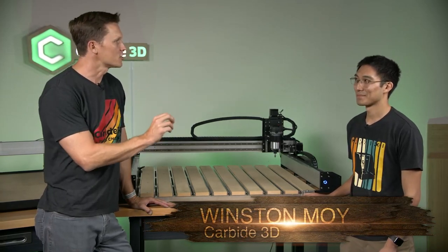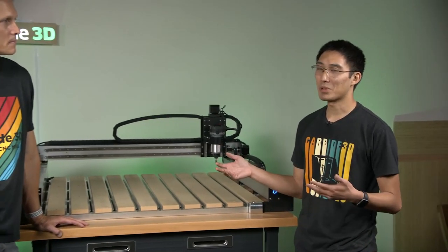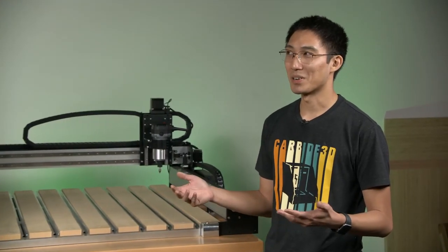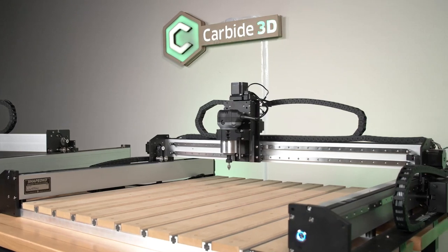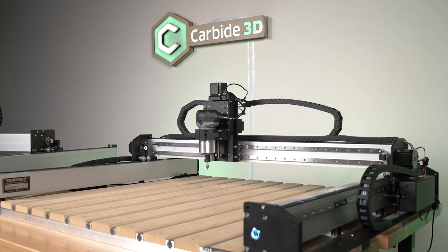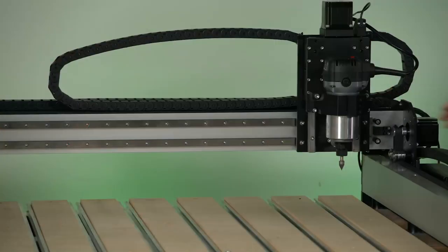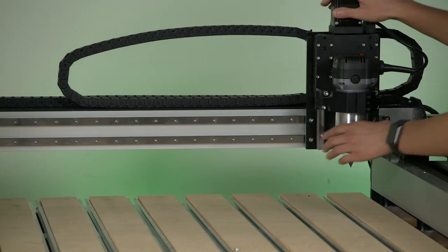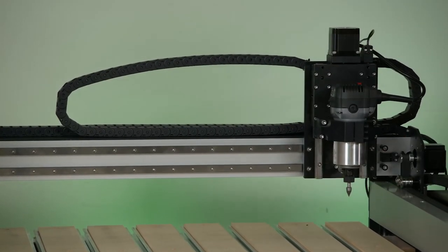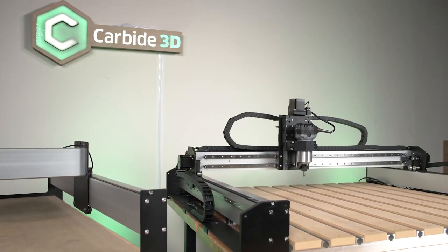What was the thinking behind it initially? Why go to a Pro? Well, we have the Shapeoko, which is a fantastic product, but people always want to push the Shapeoko harder. So we thought, why don't we give them the ability to do that? Why don't we improve the Shapeoko — make it beefier, make it stronger, make it faster? And this is what we ended up with. Speaking of beefier and faster and stronger, let's start with the linear rails and some of the improvements. Linear rails are great because they give you rigidity — that makes this machine super strong. It doesn't vibrate as much, you get better surface finishes on your parts, and overall you can push faster and make better looking parts. This machine is going to perform much better than the stock Shapeoko.